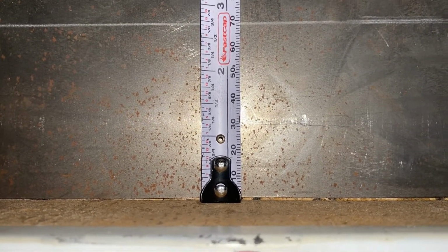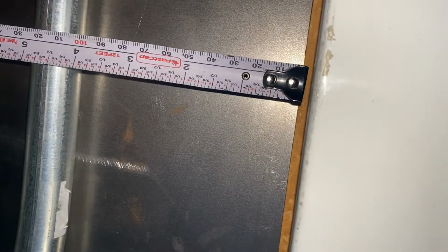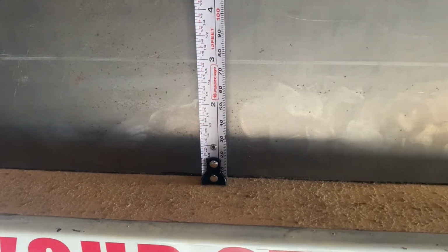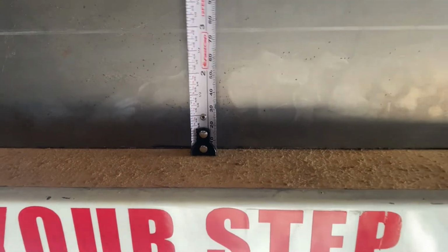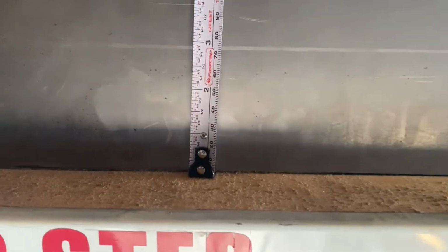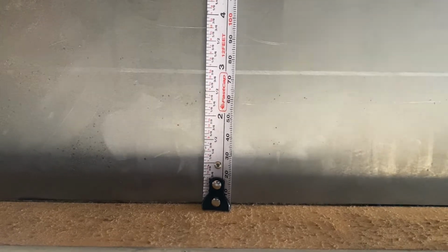And that's where the hem comes from, and we're gonna have that on the top and what would be the sides of the door frame as well. So essentially the width of our metal when we cut it will be 4 1/8. Okay, you have the 2 1/8 that we measured here for the top part, plus the 2 inches that we're gonna extend above it. But we're also gonna create that hem at 1 1/4 inches.